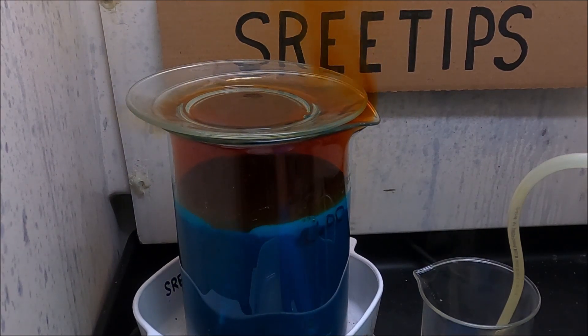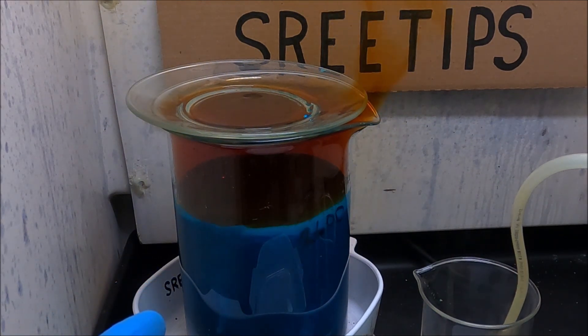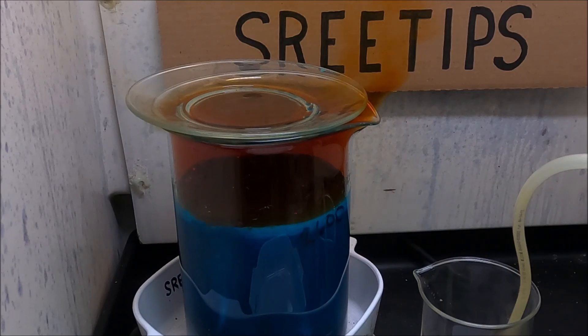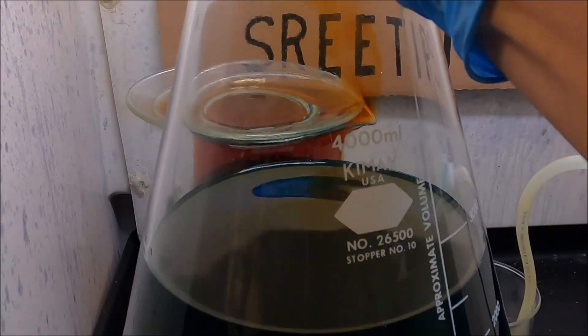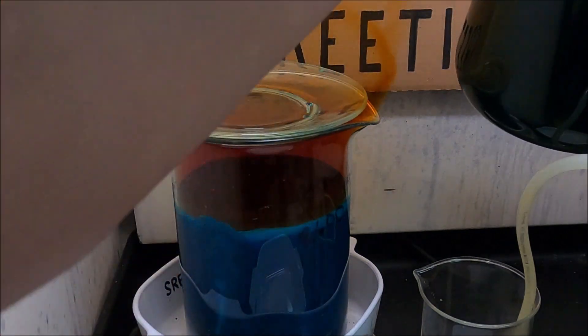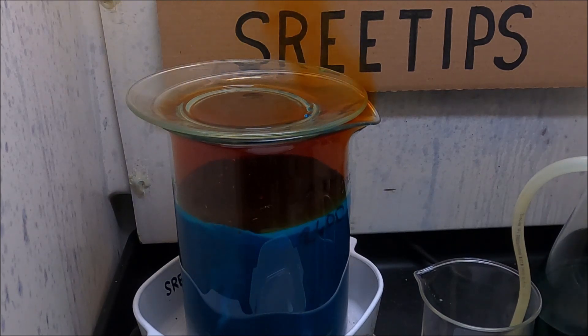So we'll just let this boil until the fumes lighten up a little bit. I've run out of room in here, so once the nitrate that's in there has been consumed — I'll be able to tell that when the fumes go away — we'll let this cool, I'll add some distilled water, and we'll get the liquid out of here. That liquid will contain silver, just like what we've already taken off. We'll get the silver out of there later on — I don't think I'm going to do it during this video, but we'll recover that. I'm primarily interested in getting these foils recovered and then refining them with aqua regia. Maybe I'll do a separate video on how to get the silver out of these solutions.